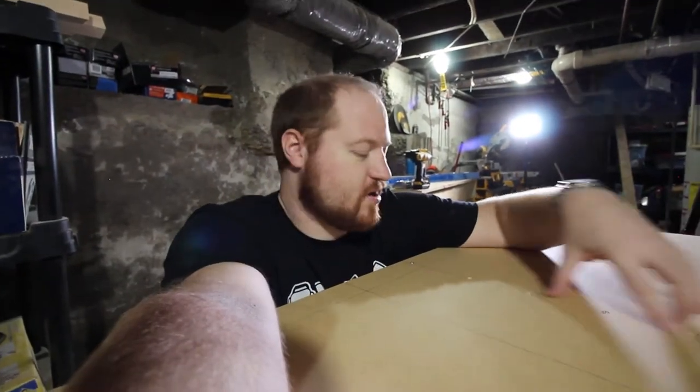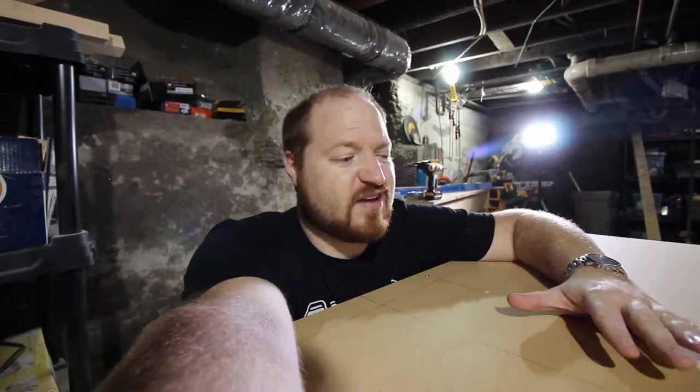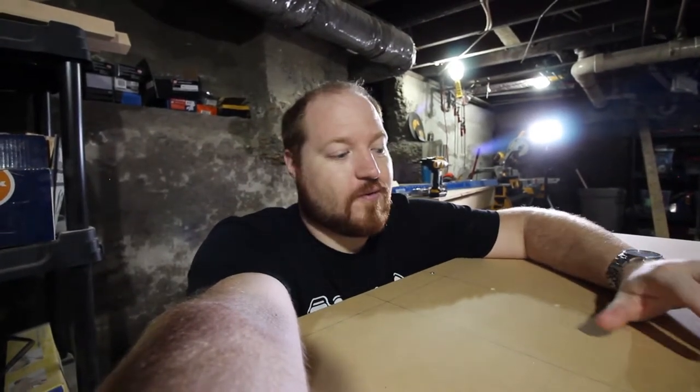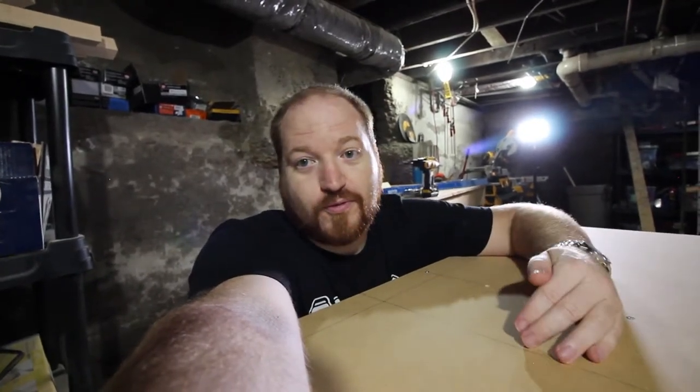Three screws holding on the rail to the platform now. That's plenty to hold it in place, but leaves me the flexibility to move it if I have to. Everything's lined up the way it should. All the markings are where they're supposed to be. Everything looks square, but you never know. So I'm just being cautious and not gluing it until the end. Right now, I think the next step is to raise the blade up through the wood.